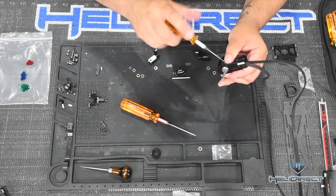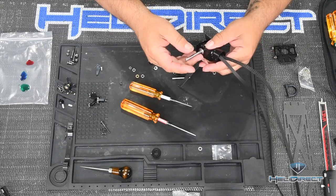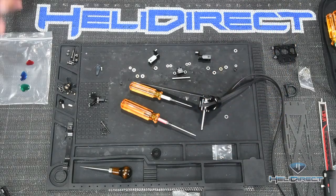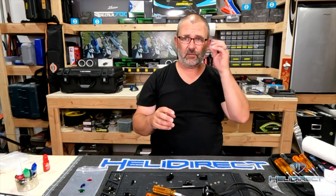So one of the things I like to talk about whenever I'm building a tail is that it's one of those deals where every single step you do in the process, you take time after each step. So as we get the tail pulley on, we're just going to spin it and make sure it's smooth. We're going to make sure there's no play in it, that everything's fine. And every last piece of the tail you do, check: does it move smoothly? Does it move freely? Is there any friction? Does something feel tight? Is there any resistance? You want the answer every time to be: it's smooth, there's no resistance, it feels tight, and it only moves in the directions it should. If there's play in a direction there shouldn't be, and we'll talk about some of these as we go through, then fix it. Address it, think about it, fix it. Because all these people that have tail wag frustrations and everything else, 9 times out of 10, that is a mechanical issue, and it's something that you could have addressed during the build on the tail. So take your time when you're building the tail and really check all of these things as you go through.